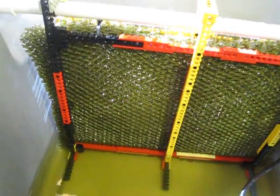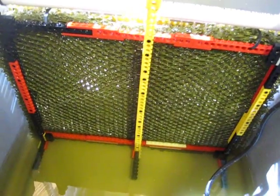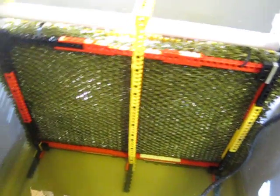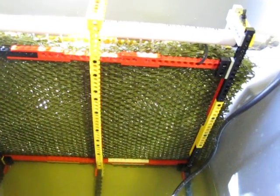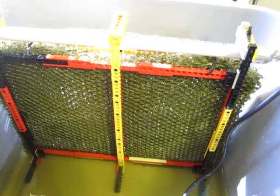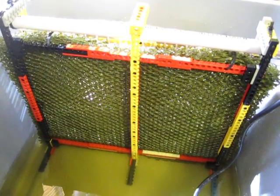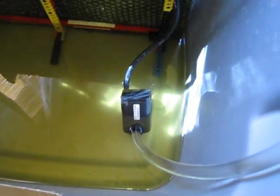This is what actually cools down the air — it's called a media pad. The brand name is Cooler Pad, and you can find it at most big box hardware stores. I like this much better than aspen, because aspen is hard to cut and leaves bark shavings all over the place — it's really messy. This is easy to cut, more sturdy, and the cooling effect seems to be about the same if not better than aspen pads. I really like this a lot.